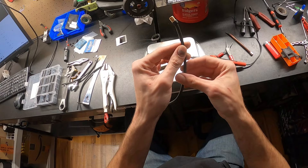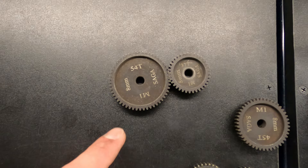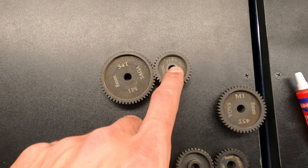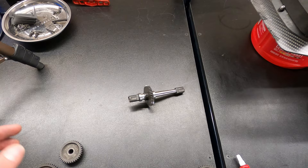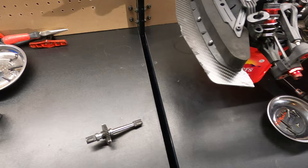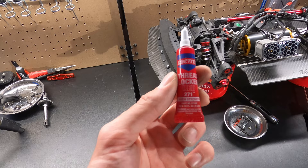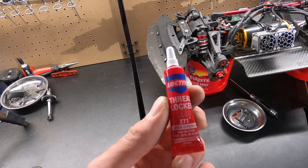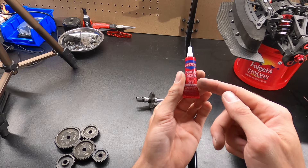All right, we're getting ready to gear up the Limitless. Last year I hit 154 on a 54-37 combo — 54 pinion, 37 spur. I'm trying to use smaller gears so there's less mass to be turning. Last year I just went for the biggest gear possible, but now I'm learning less mass, less weight is always better. So we're going to stick with the 50 pinion — a little bit smaller — and throw in this 30T spur to replace this 40T. You're probably wondering why I call it the mustard sauce — it's not even yellow. Because mustard has vinegar, and this channel is full of piss and vinegar. This thread locker is great for pinions and spurs because it doesn't come loose, but the downside is you got to use heat to get it loose.